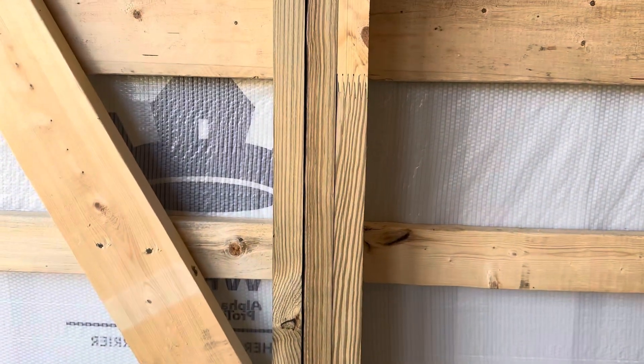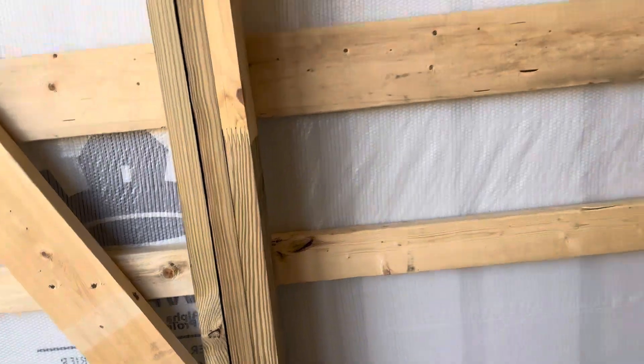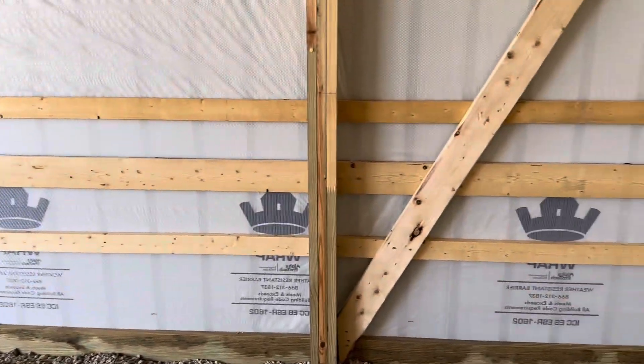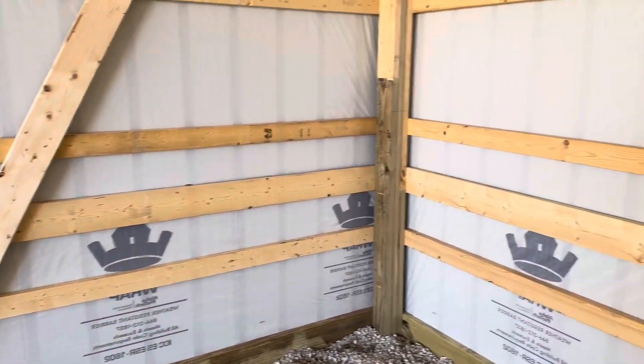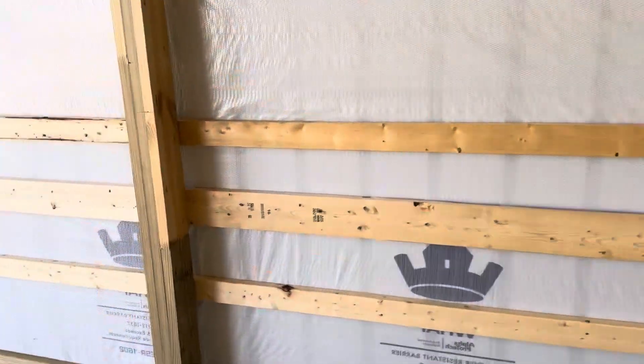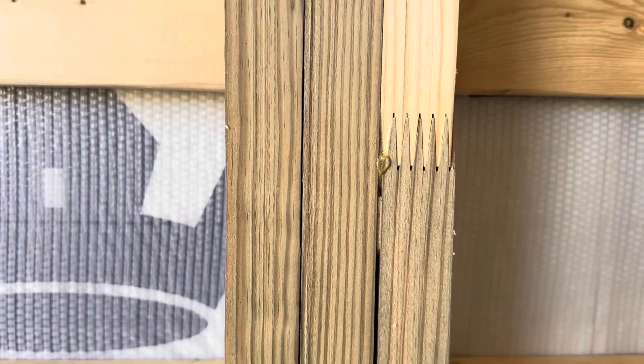You can see right there a pressure point. Somebody asked what part of the column is out of the ground — it's four feet. So four feet above the ground is a treated section, and we're going four feet in the ground as well. You can see the different splice points on this three-ply piece of wood — see how it's finger-joined, finger-joined laminated right there.